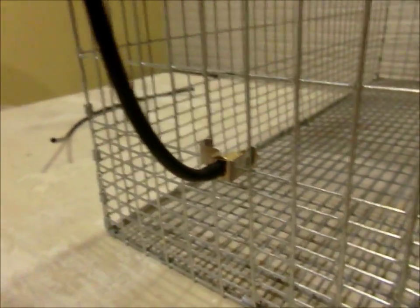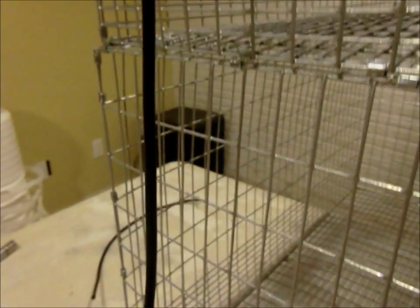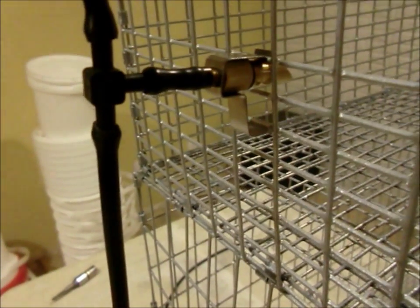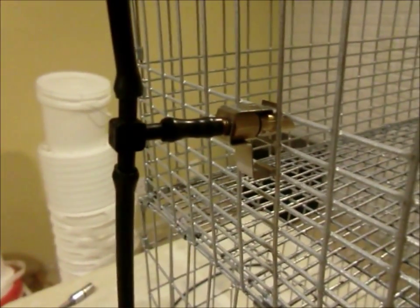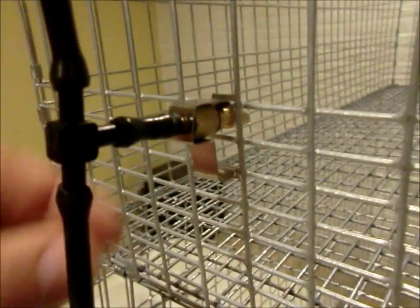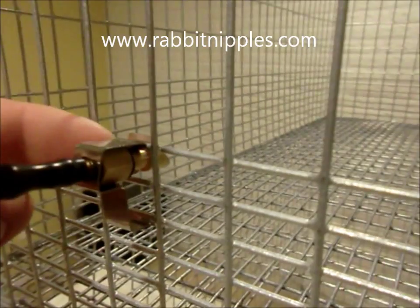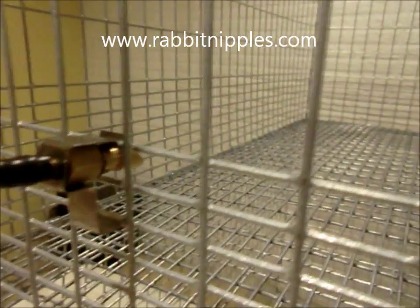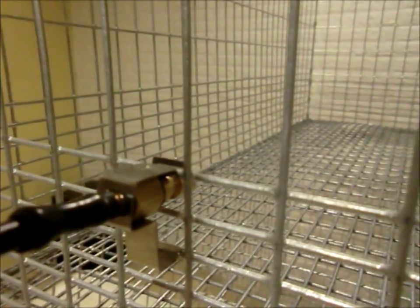Like on some of my other videos with other nipples, this is showing maybe how you'd set it up, but there are numerous ways to do this. On this top one, I have the cage clip going vertically instead of horizontal. You do need a one inch gap from top to bottom of the cage clip, whether it be between a half inch and a half inch here, which it fits in, or it can actually fit in between half by one also.